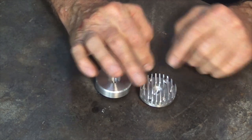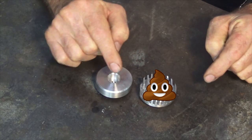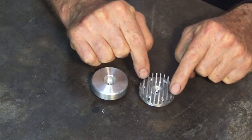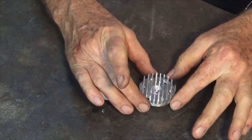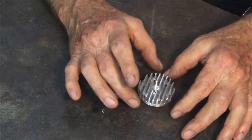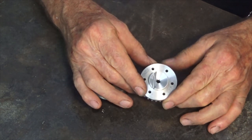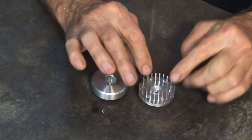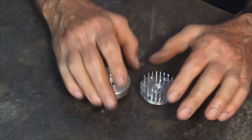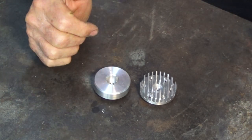I went through and decided I would try all the machining processes on the scrapped part. At first glance it looks great, except it's not. The hold down bolt holes aren't aligned correctly with the grooves that create the fins. When I set this up to cut all of the grooves for the fins, I didn't have it tight enough in the fixture and it rotated and dug out the corner of two fins. Also, the slot on the underside isn't clocked correctly. So basically I made a whole bunch of rookie errors on this one, but I've learned from my mistakes.